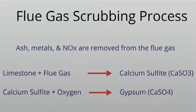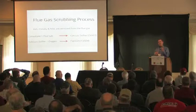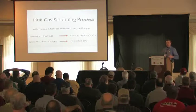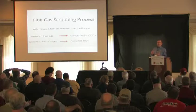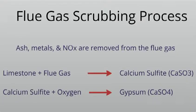The ashes, metals, and some gases are removed by electrostatic precipitators, filter bags, and other processes. Then the limestone in water solution is sprayed up into the flue gas — which is pretty much a clear gas at this point — and that calcium carbonate reacts with the sulfur dioxide, making calcium sulfite, which is kind of like toothpaste. They then add more oxygen, ultimately getting a slurry of calcium sulfate gypsum, and draw the water out with a vacuum on a filter press.